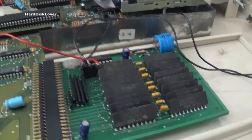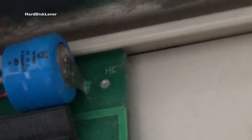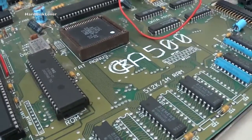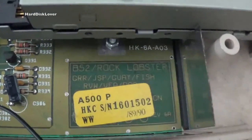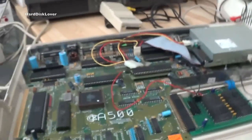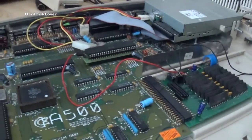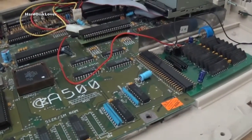I'm still pretty curious about finding out what exactly all this is. The battery is still almost okay — I assume it's just starting to leak. A little bit has already dropped on the socket board, but that can still be removed fairly easily. I did have a Kickstart 3.1 chip lying around and I'd like to try putting that in this machine, because we've got a 6A revision, which I think is pretty weird given that this should actually be a lot older machine due to the Commodore logo on the keyboard — but maybe the board has been swapped out.